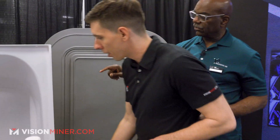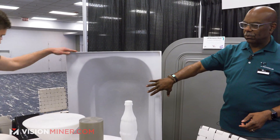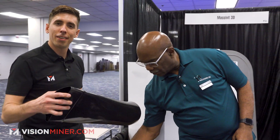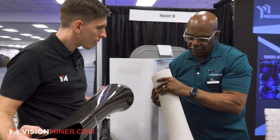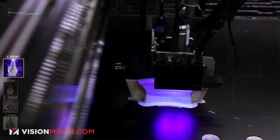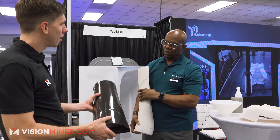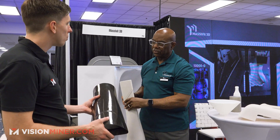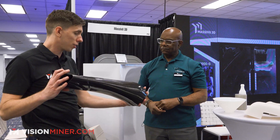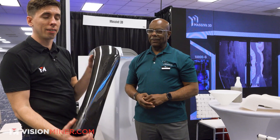This is a part that's been pulled off the mold — the mold was created for thermoforming and the part was thermoformed off of it, utilizing the same water-breakable material. You print a mandrel, wrap it, then put it in water. You end up with your in-use part without a permanent mold — just the sacrificial piece. So you're printing a sacrificial mold, making the part, washing out the mold, and you get your hard part on the outside.